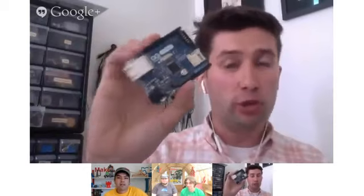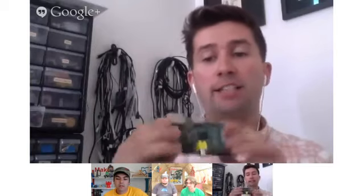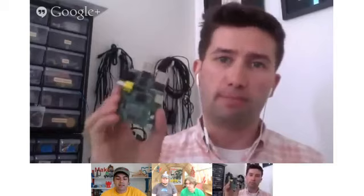There are plenty of differences. If you want to hook up sensors, it's a little bit easier with an Arduino because it has analog inputs. The Raspberry Pi has video outputs, which the Arduino does not. So it depends on your project: if you want a really simple project with just buttons and LEDs, Arduino is a good choice. If you want to use video, draw on screen, or connect to the internet, check out what Raspberry Pi can do for you.